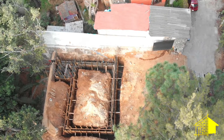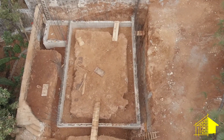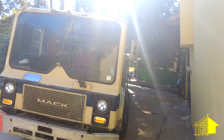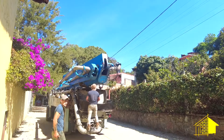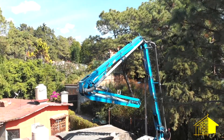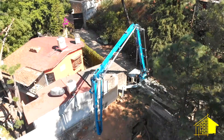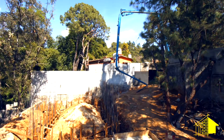In this video we'll be going from a completed rebar and wood foundation form to a completed concrete foundation. Now that all the concrete forms are in place, we're bringing in the cement crane and pump. We'll be bringing in five cement truck loads each containing six cubic meters of concrete. The cement crane is essential on this particular section because of the tight space, the depth of the foundation hole, and the amount of loose clay piled around that we have to avoid knocking into the hole before the concrete is in place.